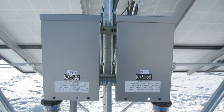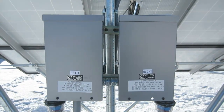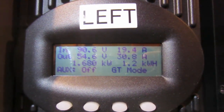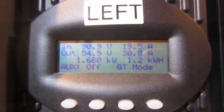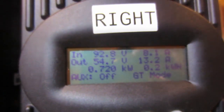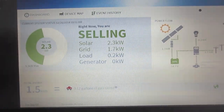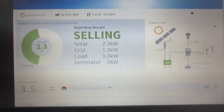To make it simple, I asked Big Dog Solar to label the panels on the back of the solar array and to match up the labels on the charge controllers, so I know there's no question that we're looking at the same information. Looking at the charge controllers, it's very obvious where the majority of the power is coming from. The left bank is generating 1.68 kilowatts and the right bank is generating 0.72 kilowatts. So it is obvious that the majority of the power is coming from the left bank where all of the panels have been uncovered. We're now up to 2,300 watts being generated from the panels.